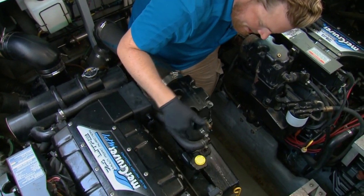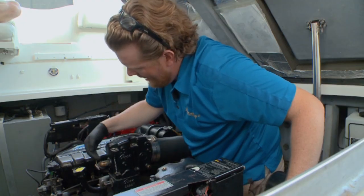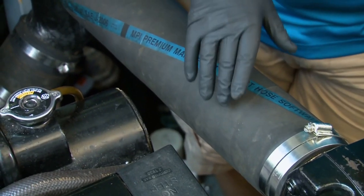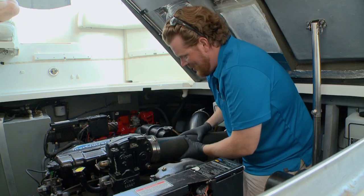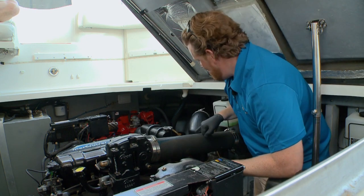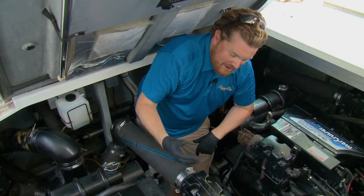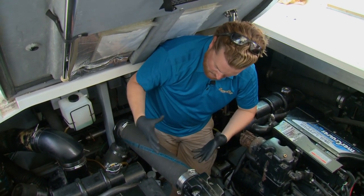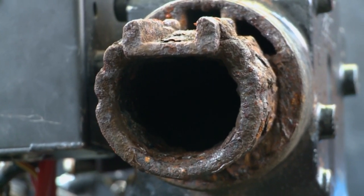So how did it get this bad? See this hose right here — this is raw water coming in from the lake, and it goes right into the exhaust elbow. The water comes around and mixes with the hot exhaust coming from that big hole in the middle of this tube to cool it down, because the exhaust is so hot it would melt it. You can see right here: premium marine wet exhaust hose. Hundreds of hours of having fun on the boat means hundreds of hours of steam, moisture, wetness, and condensation eating away at this over time.